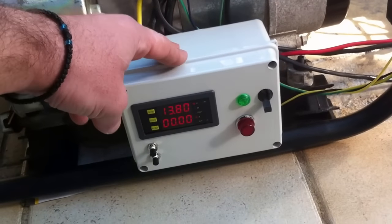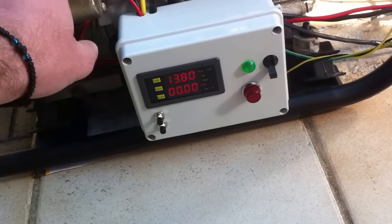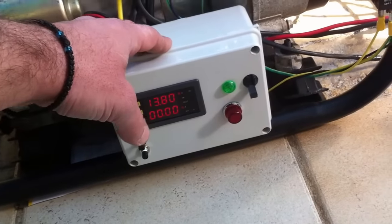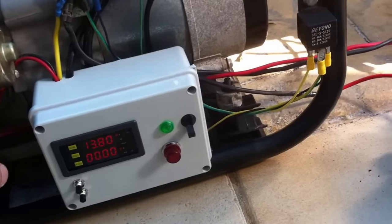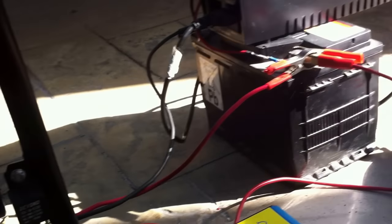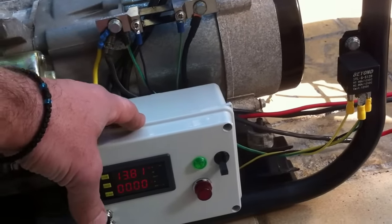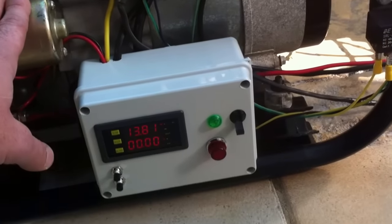I have a small circuit board. Just for demonstration purposes, I've got the generator set to start at 12.3 volts — so when the circuit board senses that our battery bank has dropped in voltage, it will start up and also act as a UPS battery charger to bring up the voltage. And again, for demonstration purposes, I've got the circuit board inside to sense when it reaches 12.7 volts, it will turn off the generator.